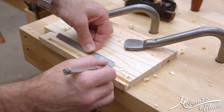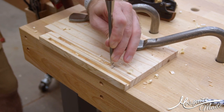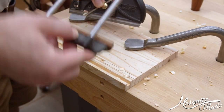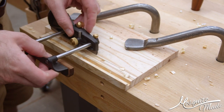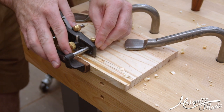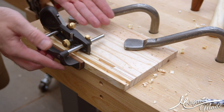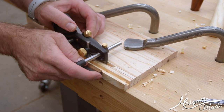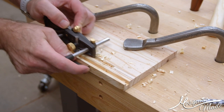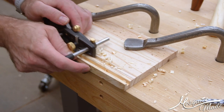We're going to try for something a little better than that. I'm going to mark out the other end again — the same inch and a half, inch and a quarter for the front part of the skate on this end. What I'm going to do is flip the plane body around, because with this groove placement everything clears and I have enough room. It might not work if the groove isn't inset far enough, so that's where having an additional left-handed plane might help. But basically it's the same thing: you're cutting down into the groove and into that front pocket you chopped with the chisel, exactly the same way as the right-handed side, but cutting back from the other direction. It seems to work pretty well.